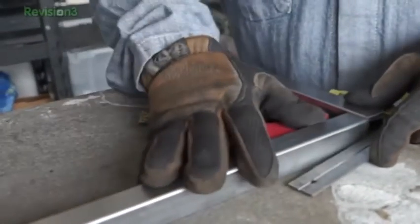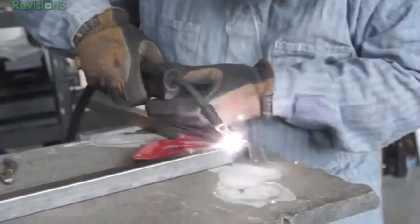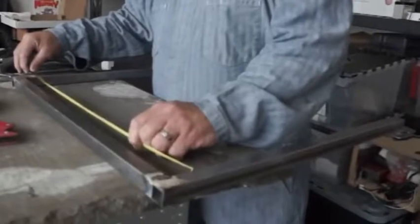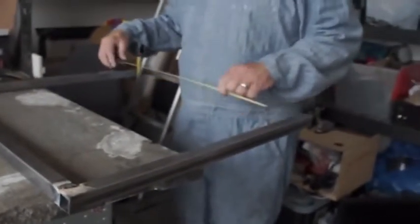And then we went to the upper piece, which is a U made out of the 1-inch tubing. That slides freely inside that 1 1/4 inch tubing. And the reason we built the upper piece first was so that we could use the upper piece that has to slide up and down to keep our two legs vertical and aligned, because it would be really awkward to not be able to move the legs because they bound or because the tubes weren't square to each other.